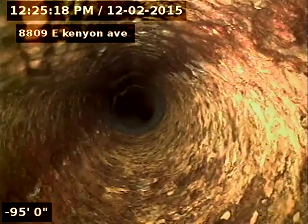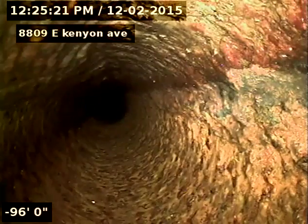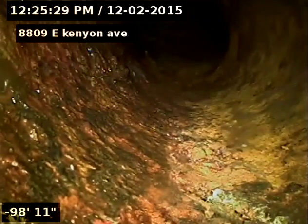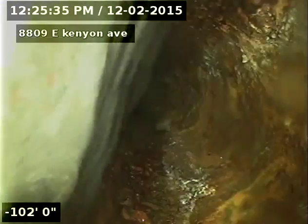You've got a belly, offset, cracking in the pipe, a large hole. With that being said, I do recommend replacement of the sewer from the cast-iron-to-clay connection to the city sewer.